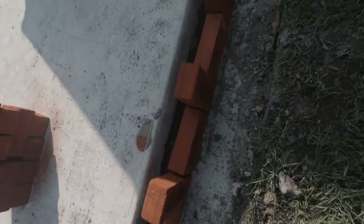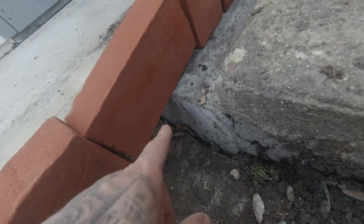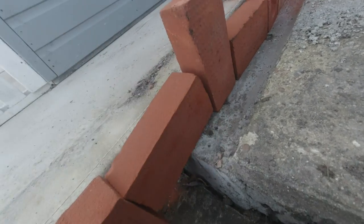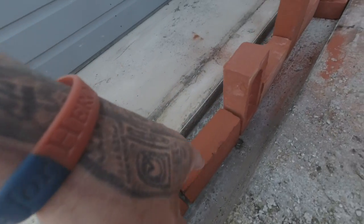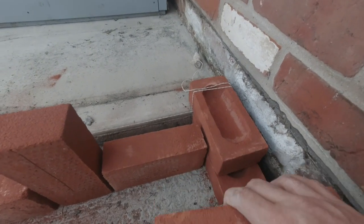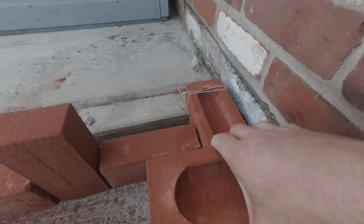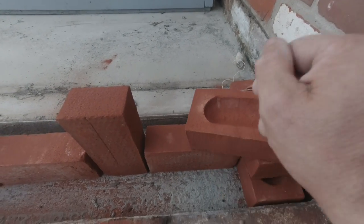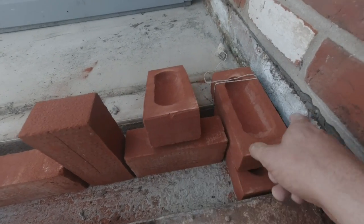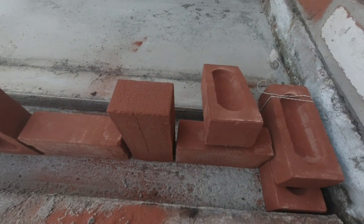So now I've bonded my wall all the way through. Bearing in mind, this goes up 2 courses here, so the first course will be the same as the third. This is the third course, first, so it flows through and runs full to a full brick this time. So what I'm going to do this time is run a 3/4 up this one. If I put a 3/4 there, that'll then make a header above. So I'll put a 3/4 in here, then the header, and then it'll work back. The bond will work perfect again.